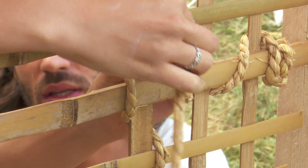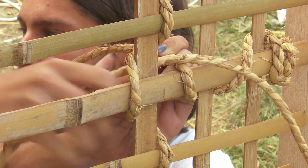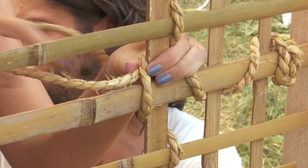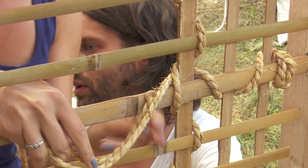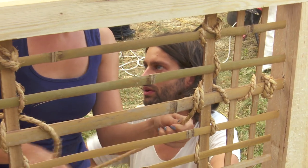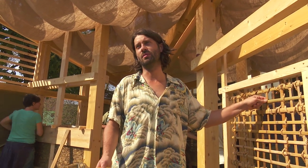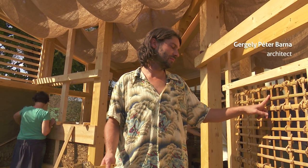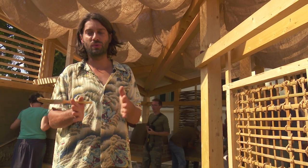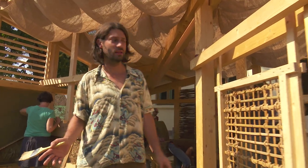This is a small sample of a Japanese wall, a traditional wall. What is typical about Japanese walls is they are really thin. I think in Europe, earth walls have the image of being quite thick. Even wattle and daub technology is quite thick, probably like 10 centimeters, but a Japanese wall is typically 6 centimeters. That's a normal wall. This is because the country has lots of earthquakes and they cannot put a mass on the base, otherwise it would break easily.